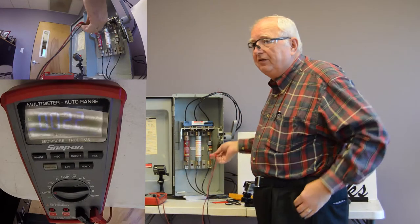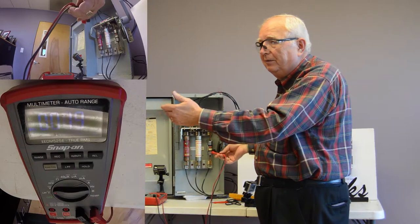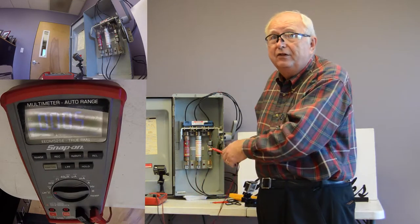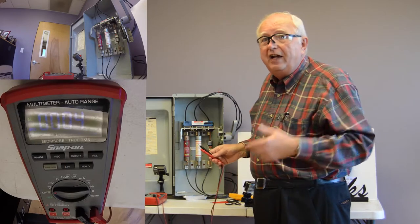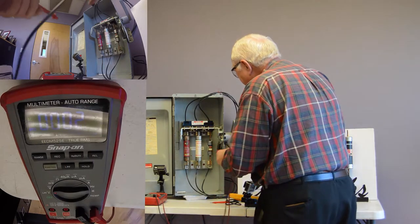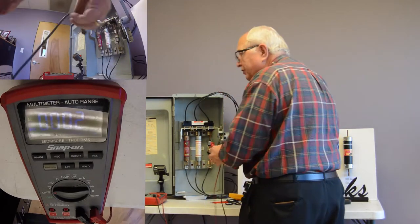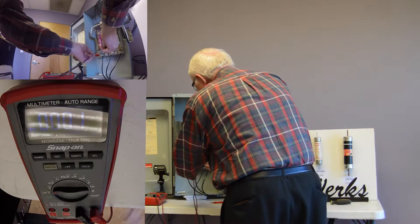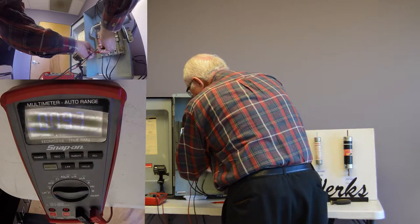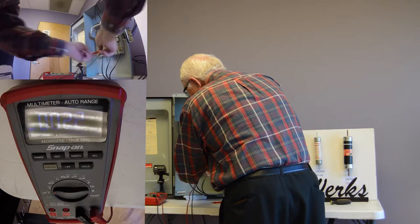That's because on this particular circuit we're feeding, there's some piece of equipment that is letting energy come back around to the bottom side of the fuse. Not all circuits have that kind of reaction. But on this one, I know there's a control transformer wired up, and that's why we're reading this voltage here. Because line to line, we're showing nothing. This will disappear eventually.